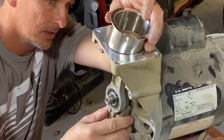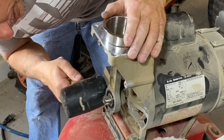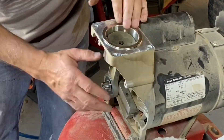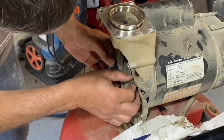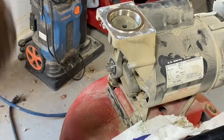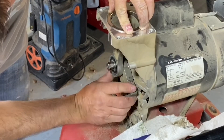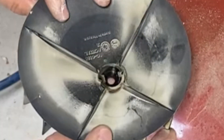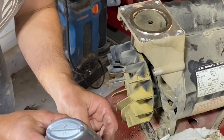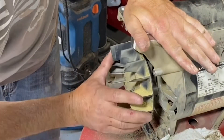It was a little tricky to get the connecting rod assembly onto the motor with the piston assembled into the sleeve, but I don't really see any other way to do it. I did have to use a rubber mallet to help tap the connecting rod assembly back onto the motor shaft. It might also help to lower the piston all the way down to the bottom of the sleeve without fully removing it — that might give you some more slack to get it started on the motor shaft. Once you get that onto the motor shaft, go ahead and put the bolt in place. Once tightened down, I held the sleeve in position and rotated the motor by hand to make sure everything felt okay and nothing was binding. You will feel the friction of that piston ring against the sleeve — that is normal. The cooling fan is offset to one side where the mounting hole is, so it's pretty obvious which way it goes on; put the bolt back on, tighten it down, and I put a little Loctite on that bolt as well. Once again I rotated it a bit to make sure nothing was rubbing.